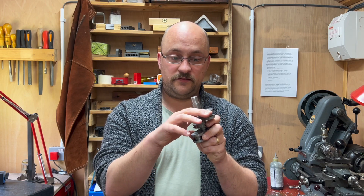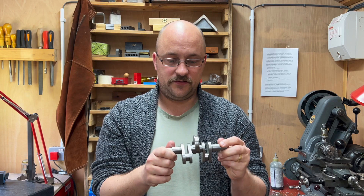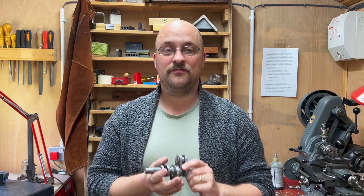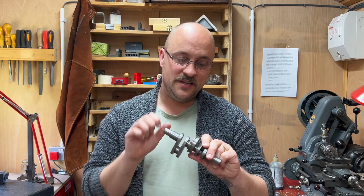There is about an 18 thou kink in one of these crank webs — like it's canted one way or the other — so clearly it hasn't gone on perfectly straight. Many people did point out to me that setting it up just laying on the surface plate with a 1-2-3 block was not going to be sufficient.